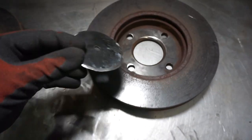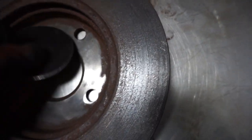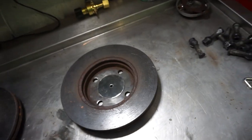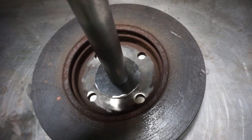Just before we carry on, you are going to need to know how to weld. I'm going to be using MIG welding, but you can obviously use MIG, TIG, or a stick welder. The plan of action is these 80mm steel circles are small enough to just fit inside and get a nice little bead on without interrupting the holes, which might come important later on. Then with the tube, we're going to put the tube around the outside, which should give us quite a solid dumbbell.